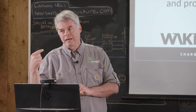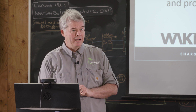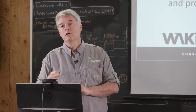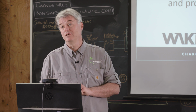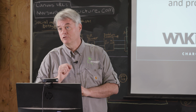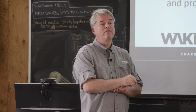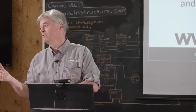Largely, the battery banks these days are lithium ion, and there are a lot of good reasons for using lithium ion. They have reached the crossover point in terms of costs. They have benefits in terms of density and performance. Their charge efficiency is higher. You want to talk about energy usage? Lead acid batteries are typically in the 80 to 85% charge efficiency. Lithium ion batteries are usually 97% charge efficient.